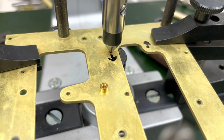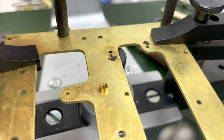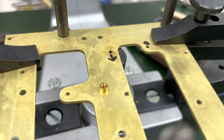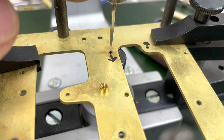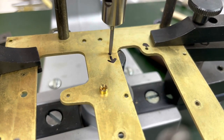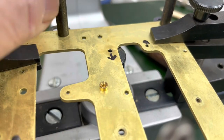Okay, I have it set up, I think, correctly. But it is a close-up, so please be aware that I'm going to be pulling stuff in and out of the scene here. And while I'm changing broaches, you won't be able to really see much of what I'm doing. It's a 3.5 millimeter bushing, but I am going to go lower to a smaller cutter, because I want to start the cut really pushing hard. I'm going to cut mainly the outside here, and as I cut and open it up, it should get me the round hole where I want it faster. Okay, that looked good.